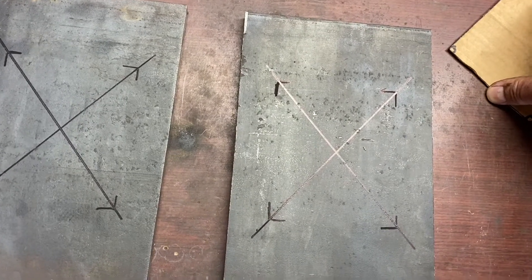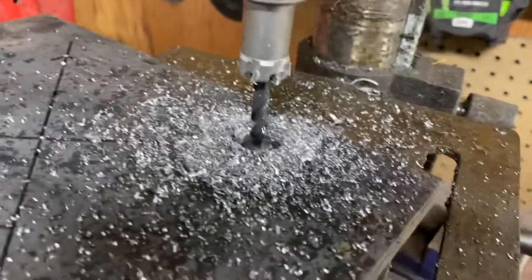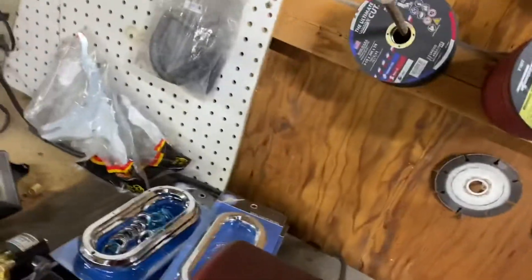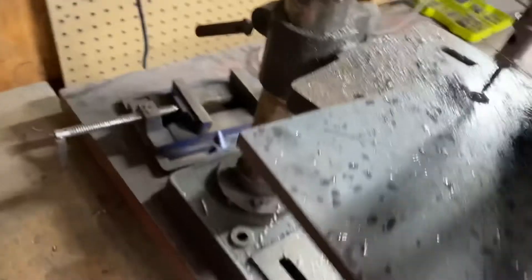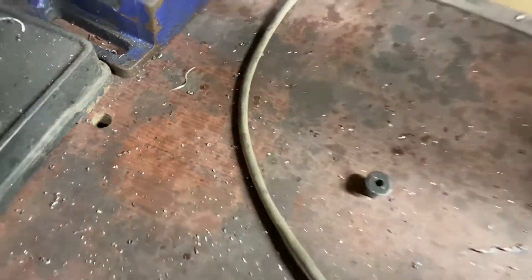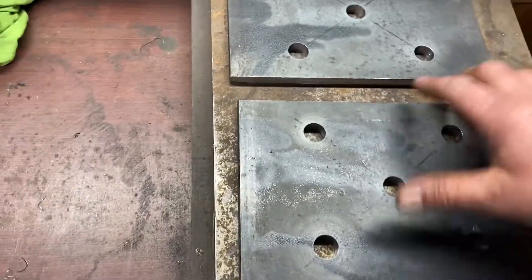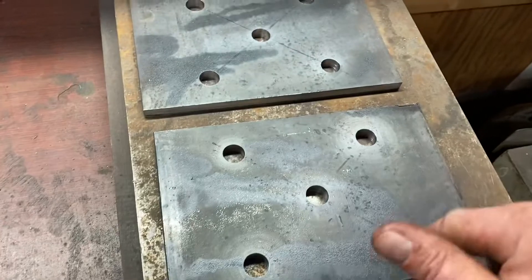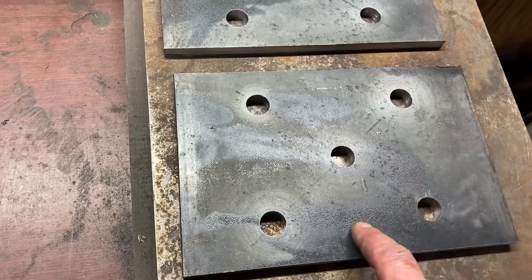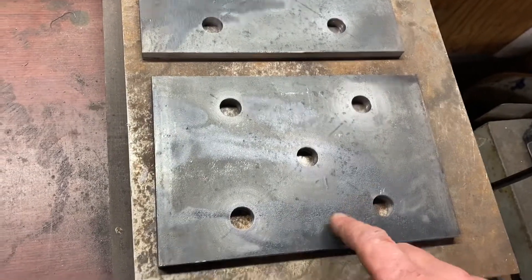The middle is where our locating pin for the spring hole needs to be — that's just a half-inch or three-eighths hole, an easier one to drill even through half-inch plate. I tried out this annular bit I bought for 30 bucks on Amazon and it was incredible — probably one to one-and-a-half minutes to drill that hole, and a spring-loaded plug pops the core right out when done. I did break the pilot on the very last hole, number 10, but that's just a quarter-inch drill bit and easily replaced. Carbide bits in mild steel are awesome.